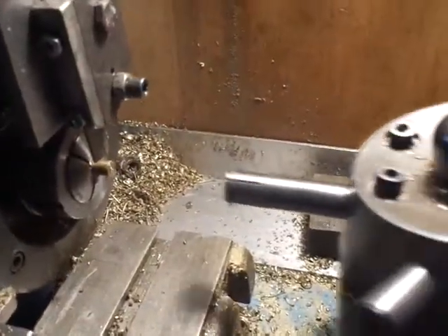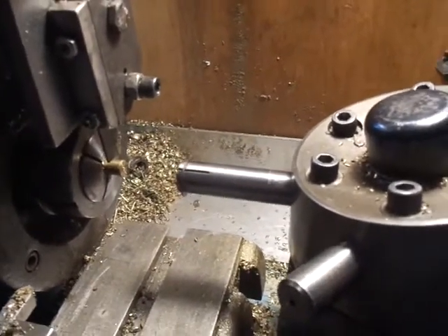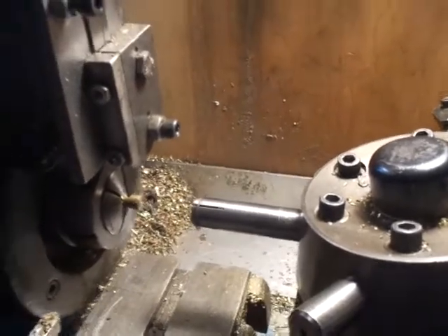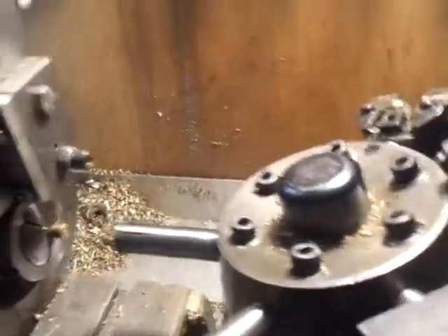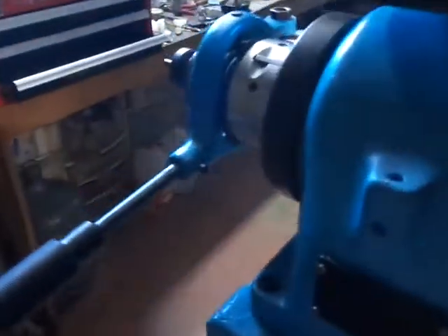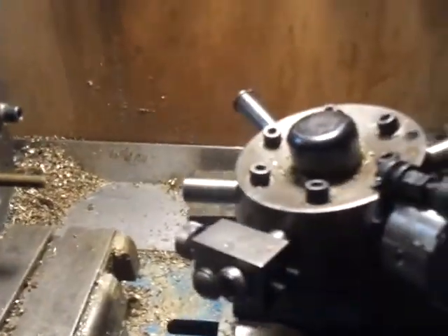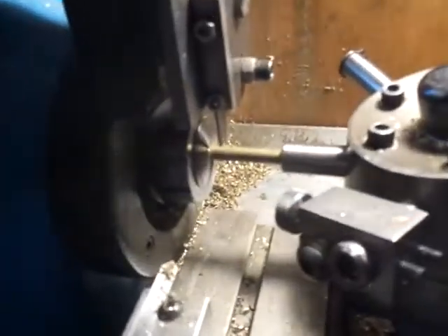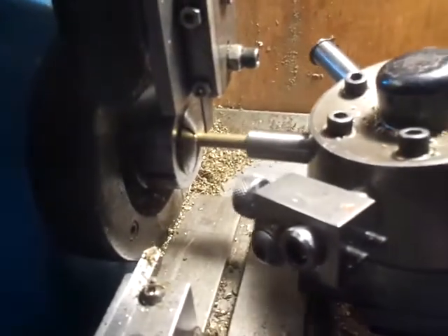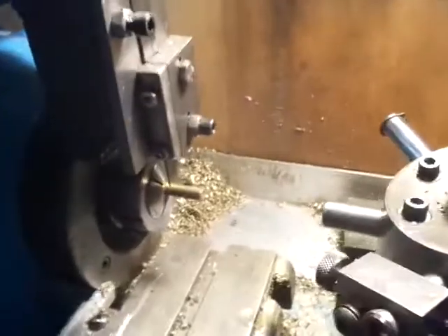I'm doing this holding the camera with one hand as I'm operating the turret here. So first we pull on the puller. I have a collet release here — it brings the stock out. Now I pull the puller off. This sets the depth of my overall length, which is about a half an inch. And I start the machine.